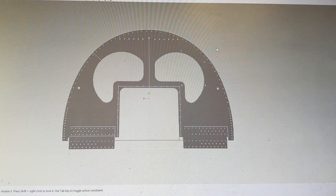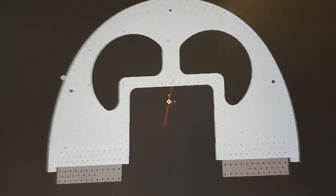The forward bulkhead, known as the bulletproof bulkhead, was of a composite construction. It was manufactured from 9mm thick armour plate to which an aluminium flange and the nose cowling seating rib were riveted. Two heavy angle brackets were riveted to the lower edge. These brackets are bolted to two similar brackets attached to the main spar shear web, providing the main connection between the bulkhead and the wing centre section. The bulkhead also provided the foundation for the forward cannon base plate, via a large diameter strut extending from the cannon mounting casting to an eye bolt at the top centre of the bulkhead.